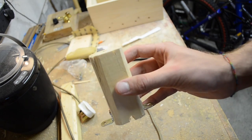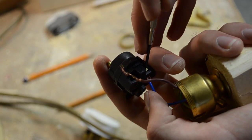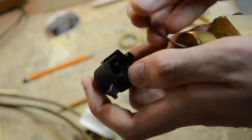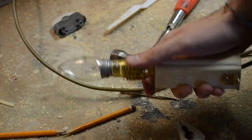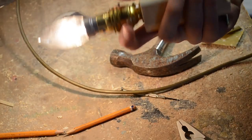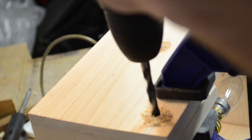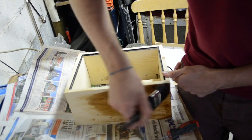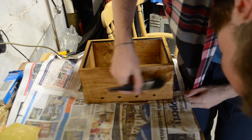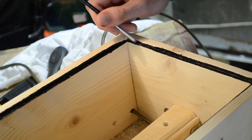Now for the light. Drill a hole through the center of an old piece of wood. Attach the electronics to the block by the instructions, or if you're reusing the parts from an old lamp, in the same way as the lamp you took them from. Plug in the bulb to make sure it works. Attach the block to the base of the lamp using L brackets. If it's to be mounted on a wall, drill through the bottom. Finish the piece by applying whatever stain, varnish, or wax you want to use. You can paint the rebate a dark color to give it a more flush appearance to the face of the lamp.